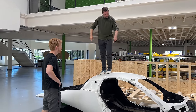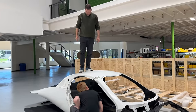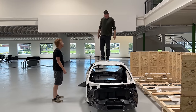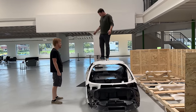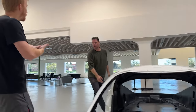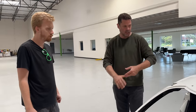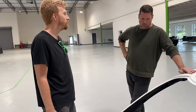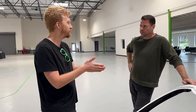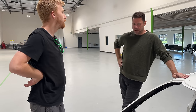This is missing some of the structure underneath — there's a roll hoop, and once we put the steel structure in we'll take a picture with like 12 people on it. People have expressed concerns about steel mixing with carbon fiber causing corrosion, but it's really about whether they're touching. If you put anything between them — like the bonding agent we use — that's the middleman. It's not new science; the BMW i8 had a lot of mixed materials too.